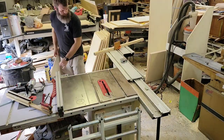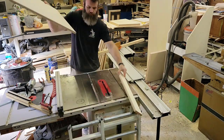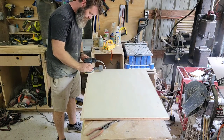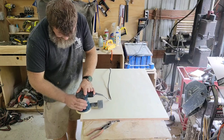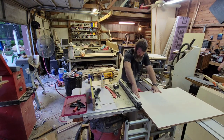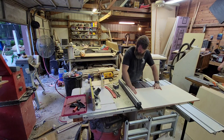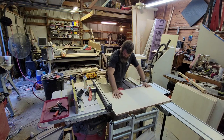Now I'm cutting the slanted dividers to length and then cutting a 20-degree angle on them — that's what matches the front of the cabinet. I did put edge banding on the fronts of those too; everything had a piece of edge banding on the front. We get all the panels sanded up before we cut the dados, and here we go cutting all the dados the same way — cut one side against the fence, flip it around, cut the other dado. It makes it way easier when everything's symmetrical.